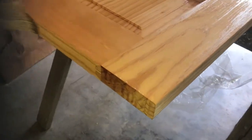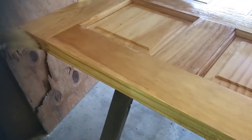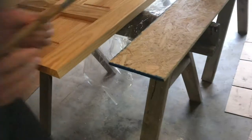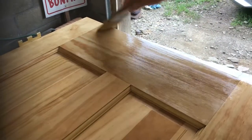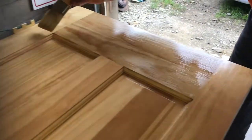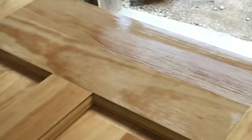When you use the brush, go with the grain. It's better to do a few light coats than heavy coats — it'll look a lot better. Make sure you use long strokes on each board to make sure it looks nice and even. Treat each board individually and mind the strokes, because that's what makes the door look beautiful when it's done.